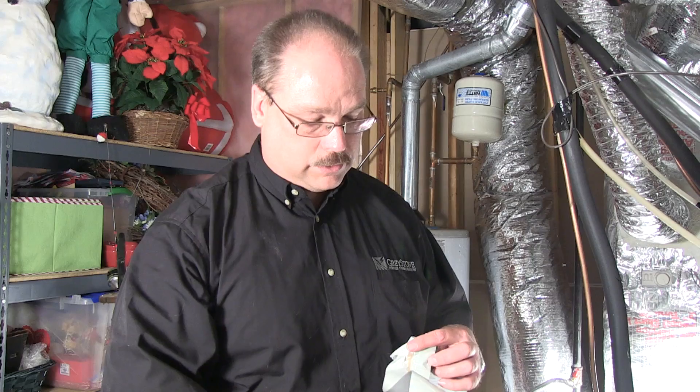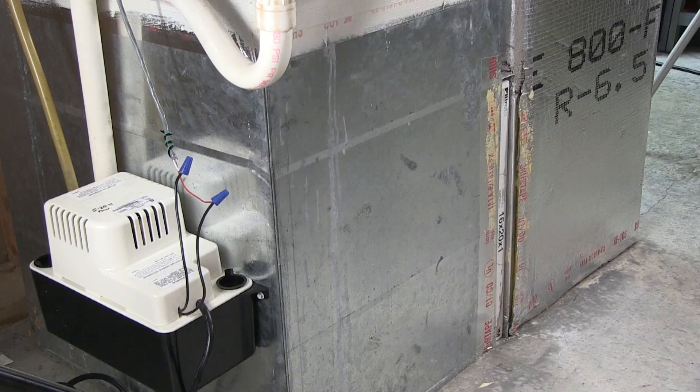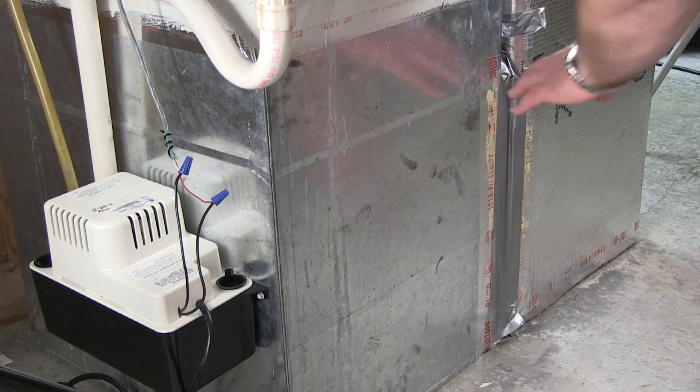The most important thing is to always seal it. I use duct tape. Some people prefer to keep their filter doors, but I would use both. The important thing is to seal that filter door. It's especially important to seal the filter door in attic furnaces, because the temperature differences in attics are extreme. That temperature can cause the unit to run longer and bring in outside contaminants that might bypass the filter.